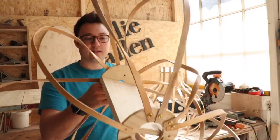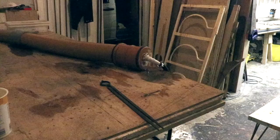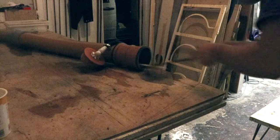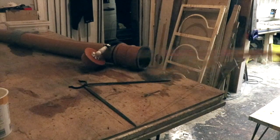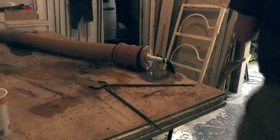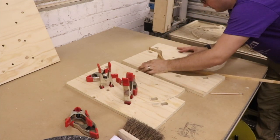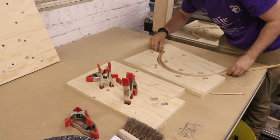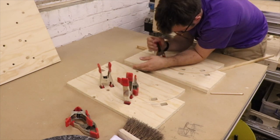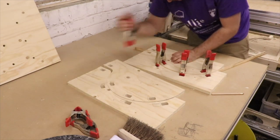So I changed it up a little bit. As you can see in the background, that's the onion-shaped light. I went ahead and cut some CNC molds so that the finished product would look a bit more symmetrical. Here I'm getting the timber out of the steam box — using tongs because it's basically boiling water — drag the strips out, pop the top back on and send them over to the formers so I can clamp them together and get a nice uniform shape. Part of the way through the process, after I realised that monstrosity of a prototype wasn't going to cut it, I made these onion-shaped formers.